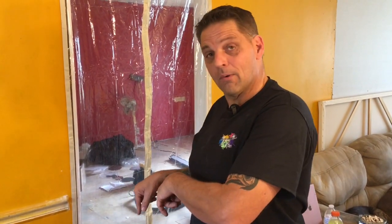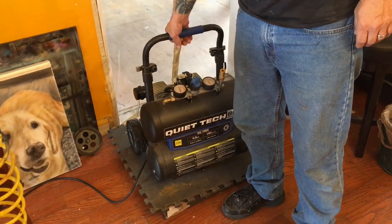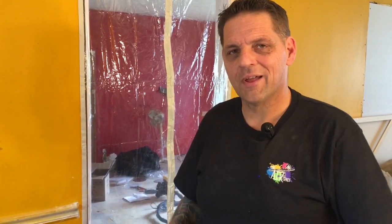Then I got this pretty heavy, maybe 40-pound box of vinyl tiles, and I'm going to place that right on top of it. Sand is an excellent source of mass — the way sand works, it will kind of fold on itself and absorbs vibrations really well. So if you have access to some play sand, build a little box, fill it with play sand, and use that for your mass and decoupling. If you've got ankle weights laying around, set those down instead of rubber pads — it will help tremendously. I laid another gym mat on top and put my compressor on top of that. That's already a three-decibel improvement, and it also stops transmitting sound across the floor into other rooms of the house.